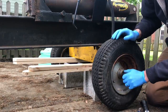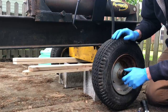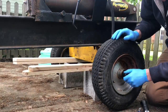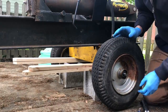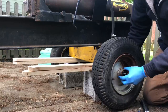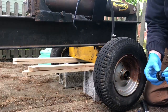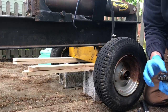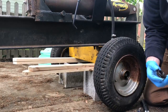Okay, and this nut shouldn't be that tight because the pin is what holds it. Just unthread that, and I've got these all going back in that little hub so they stay clean enough. And then you just want to take your tire off, and your bearing may pop out. So this is your roller bearing, and you see it doesn't have a ton of grease in it. It's a washer. Set that off.